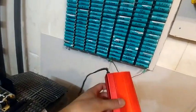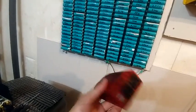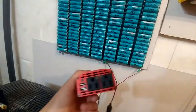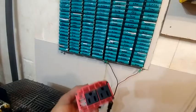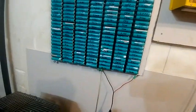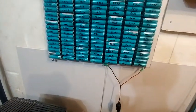This is a 12-volt, 300-watt modified sine wave inverter. It won't work because these batteries are too high a voltage, so you'd need a buck converter to chop it down to get your full voltage. I do have this guy connected — I just use a cigarette lighter for testing purposes — and it works just fine. If I do 4S, it won't work at all.